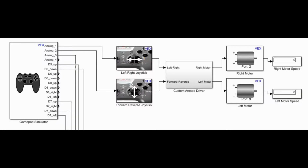The steering subsystem is the shortest, yet the most complicated. The input from the analog stick enters my custom arcade driver, where it institutes a custom-made parabolic curve, which, when combined with the dead bands I put in, makes the analog move slower the closer it is to the zero position on the joystick. This creates more fluid motion in the game.